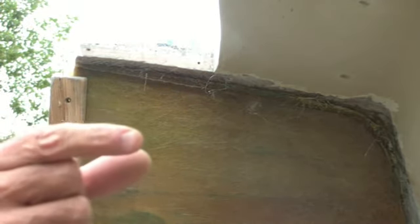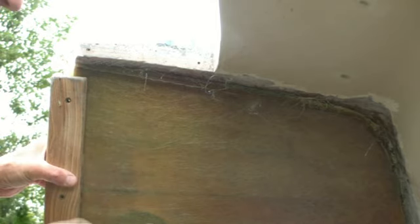The idiots used silicone for filler — like caulk — and it looks terrible. I want a nice clean line through here. The original manufacturer didn't even make it flat. Right there you can see where the compass was — they cut it out. All I gotta do is sand it all again, use my 24-dollar Harbor Freight belt sander and sand it flat.